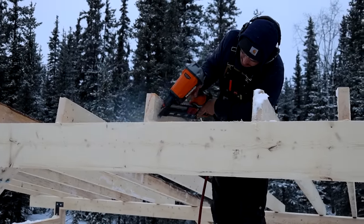But one of the other things we want to do on this structure is it's not just going to be a lean-to like this. It's going to actually have a little overhang out the front. We're going to build that out of 2x4s. Not today, probably in a couple days, but tonight what we do want to do is our posts where we anchored them into those little anchor brackets in the concrete. They're just nailed in right now. We've got some big bolts we're going to put in there, so we're going to try to drill those out, get the bolts in, and hopefully it would be nice to get on the roof again, and we're going to put some 1x's down so we can screw the metal roofing into that.